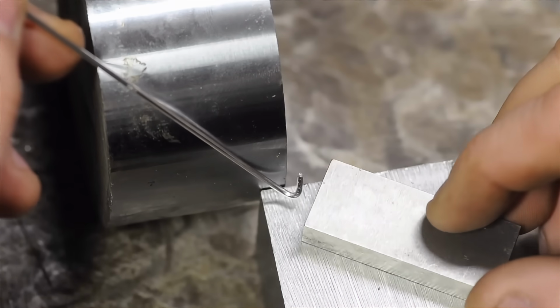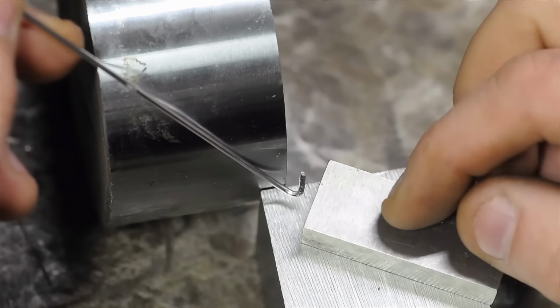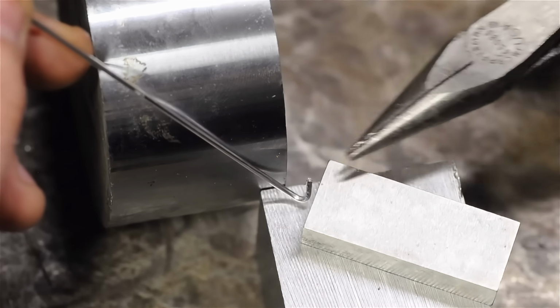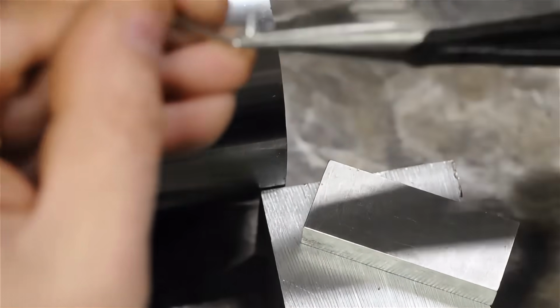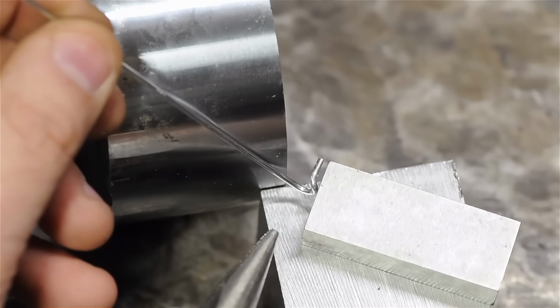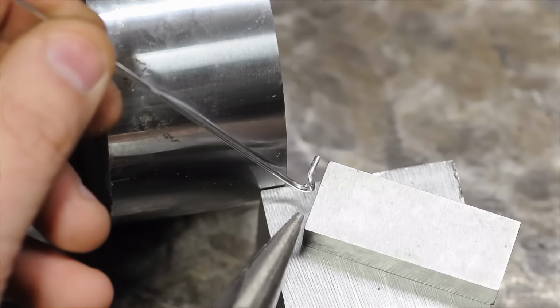What that basically boils down to is a step or some other shape on top of your tool that helps put a harder bend in that material. So first it hits the top of the tool, it starts to bend. Instead of doing whatever it wants after that, it hits another wall and it makes a harder bend still. Or it shoots it off in some weird direction to facilitate that chip breaking. This little step, or this little feature, every manufacturer's got their own flavor of it, is called a chip breaker.